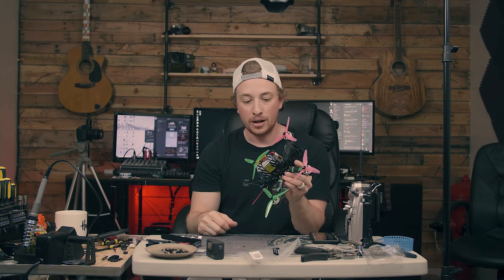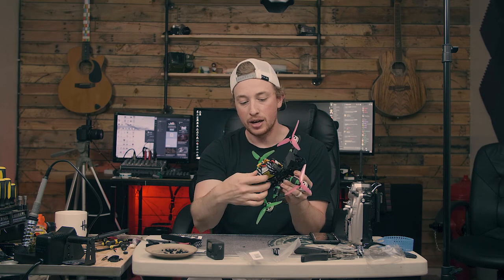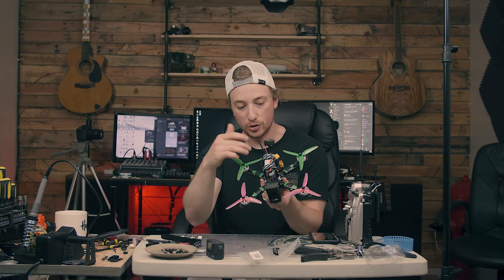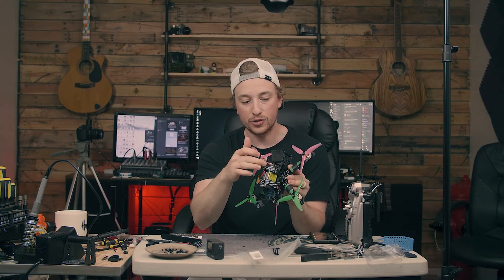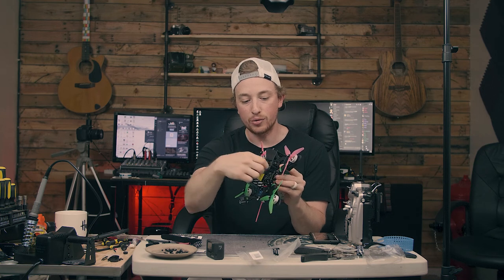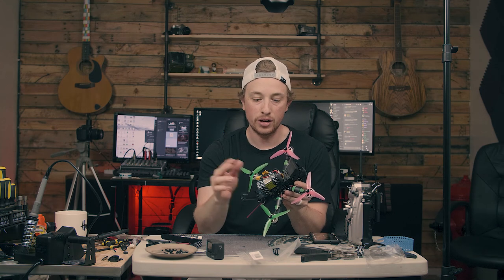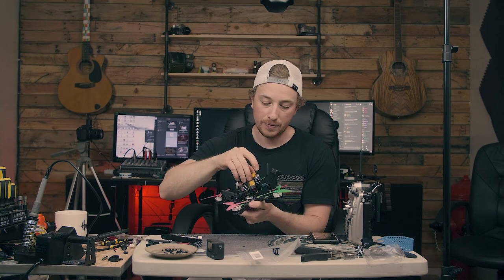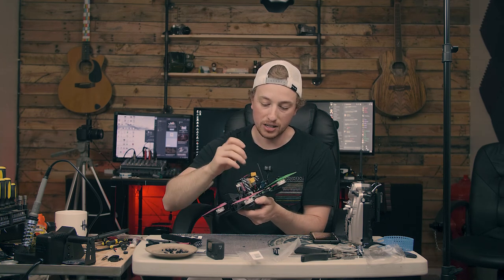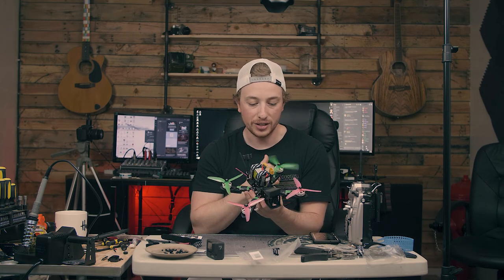And then the battery, when you put it in, you make it tight on top here. And make sure it's not pushing or digging into those screws that are on the top. And then with this front strap, you strap it through the clip and then you bend back the power cord and strap over that. So on this side here, everything's clean and it's not loose and wiggling around and vibrating or getting in the way of the props. Everything is set up really well.